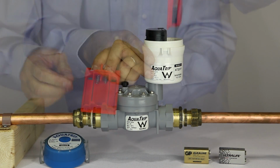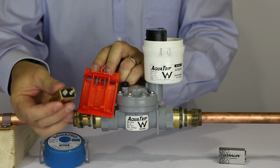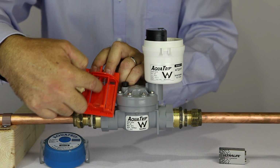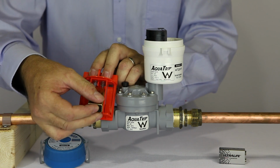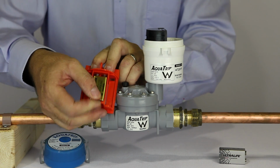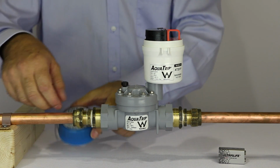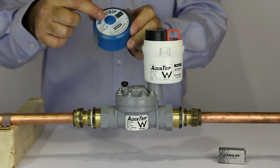Remove the battery holder. Take the new battery and carefully note the polarity and match it to the polarity on the holder. Before you reinsert the battery holder, you must see if there are any factory default settings you want to change. These will be discussed in Section 3.